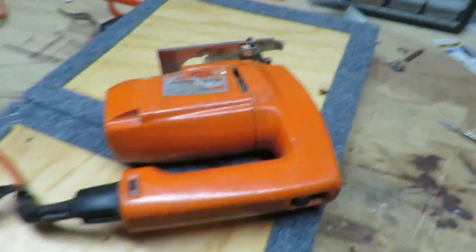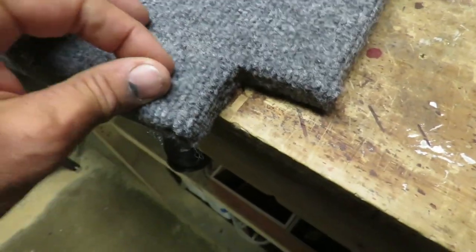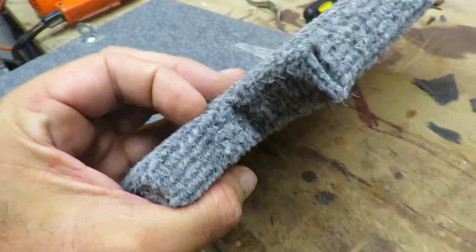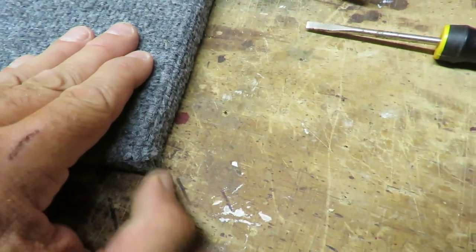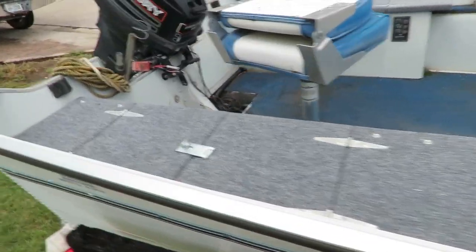I pulled the staples so the fabric can be folded out of the way. The best way to do this is with a jigsaw with a wood cutting blade. I had to pull all the staples through here, being really careful not to tear anything. It took a little bit of doing but I did get this two-inch by two-inch notch cut out. On the back side I just cut it and kept folding and stapling until it's in there secure. Since this is the bottom, what you end up seeing is this part here which looks nice. I need to put a couple more staples in the edge.